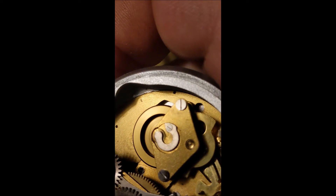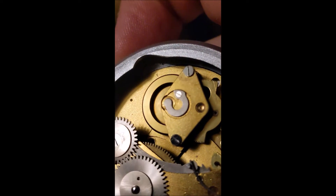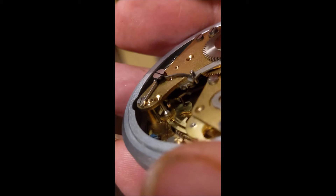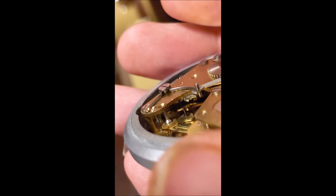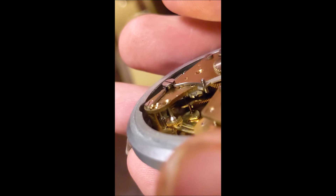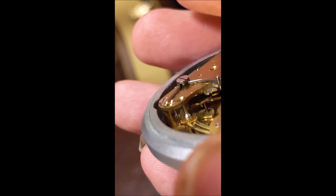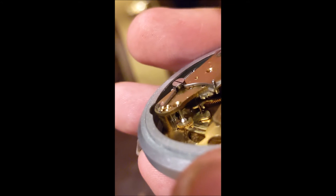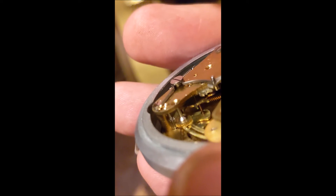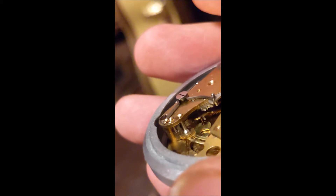Those little wheel teeth there engage on a pinion on the bottom of this flywheel. This flywheel's shimmying a little — I wonder if it has a bent pivot; it's been dropped. There's this beastly little escapement. The noise it's making is those escape wheel teeth hitting those big heavy pallet lever pins. When I last cleaned it, I lubricated those pins with a kind of grease instead of an oil, simply because I couldn't get an oil that would stay on there.